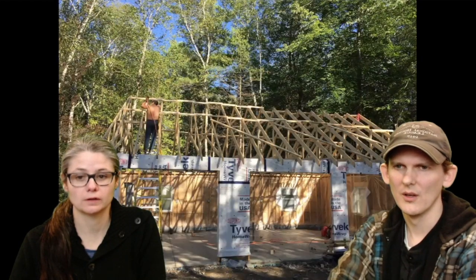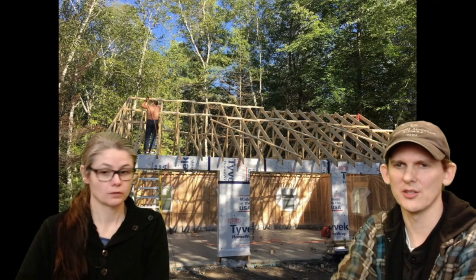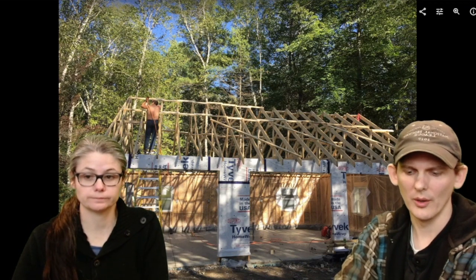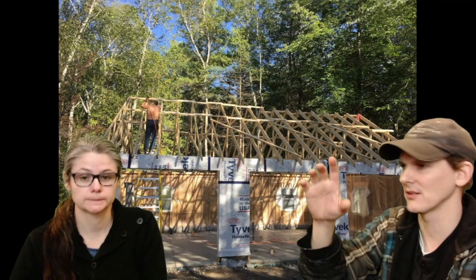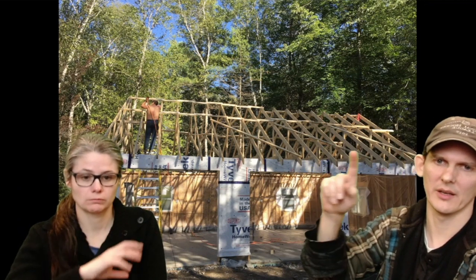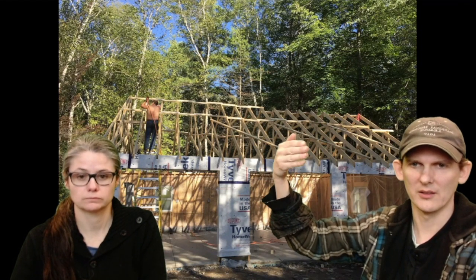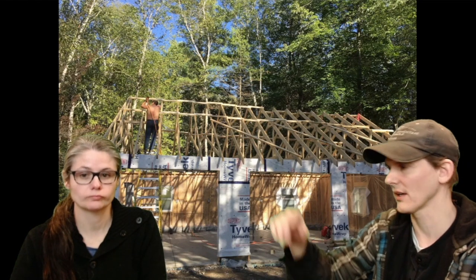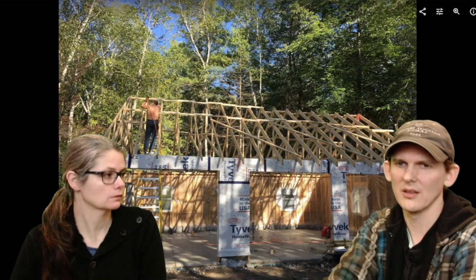Almost done. So when you buy these trusses, it comes with this entire stack of installation information. It tells you all the different strengtheners that you have to use. It'll probably tell you exactly what you need, but the long story short is that you need to protect this from moving in any possible direction. You're supposed to put 2x4s down this way, and then 2x4s in this plane, and then 2x4s in this plane. They're all crisscross and diagonal, and they show you how to do that in the plans usually, but it's a lot of extra material.